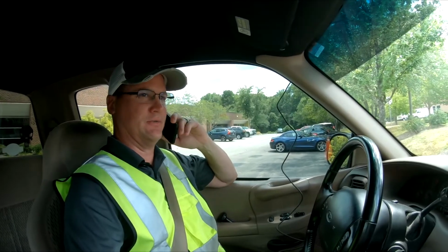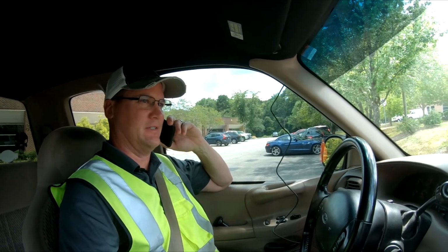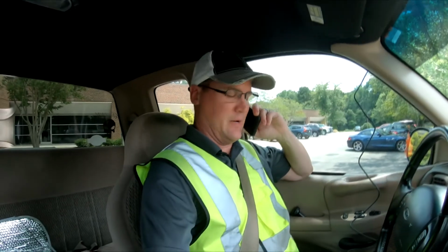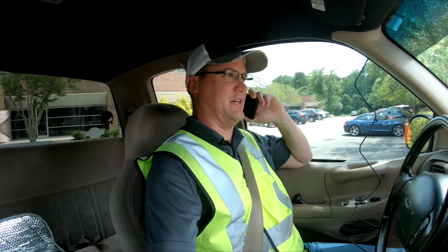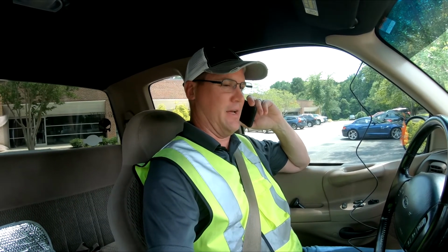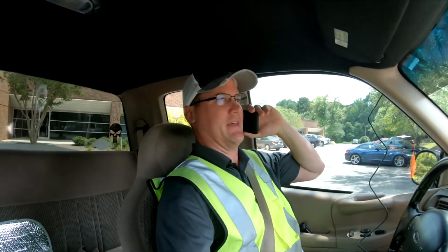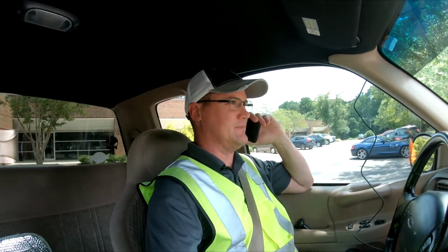Oh, it's in the manual. So set the calibration to 435 and hit enter. Okay. And once I do that, that's what I need for this kit. So calibrate at 435, hit enter, and then drive away, and it should start counting immediately. Okay, wonderful. I'll try that. Thank you. Okay, you're welcome.